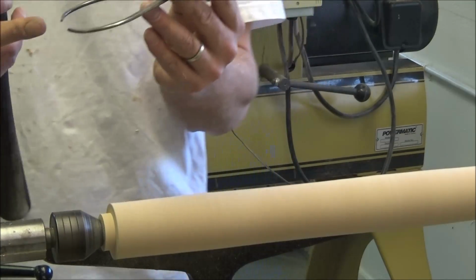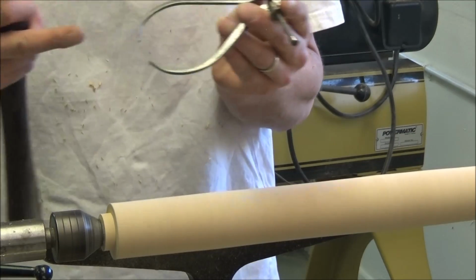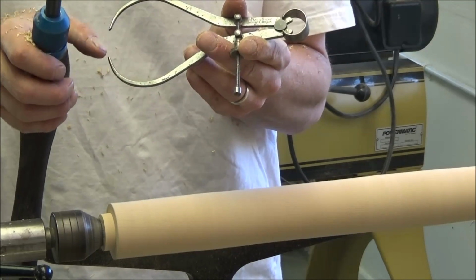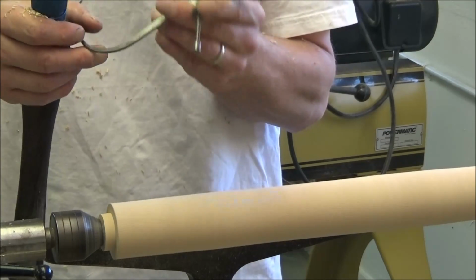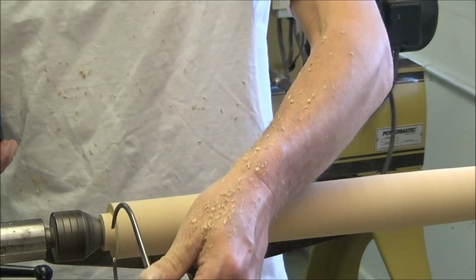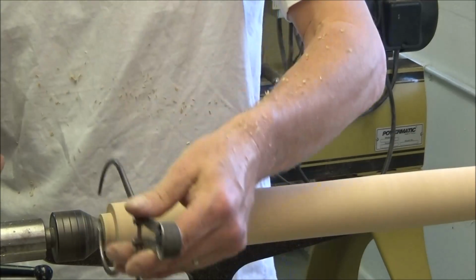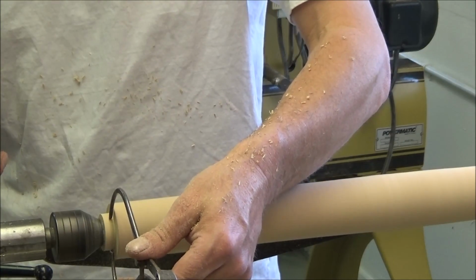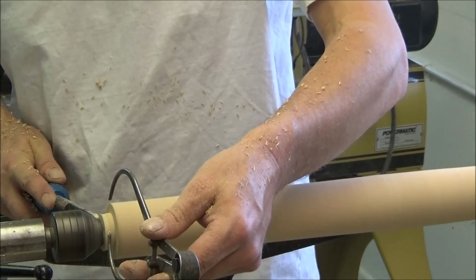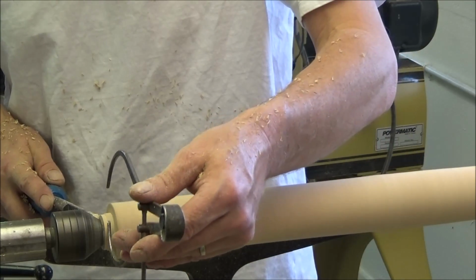Now then, if you're using these calipers, one little tip, from the factory they may be sharp on the edge. Those can catch, there may be a bit of a burr. Get some abrasive and just round over and soften those edges, and it's far less likely to catch, and have them further round here than there so they don't drag them down to you, okay? Just going to try that for sizing, not quite. Take that away. I'm going to make the cut at the front. If I get it slightly wrong, I can adjust it further to the back.